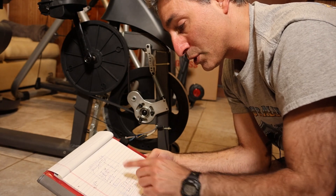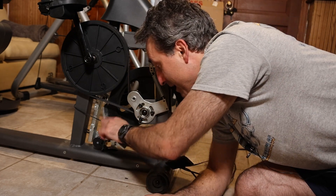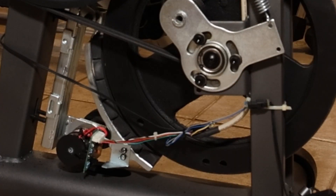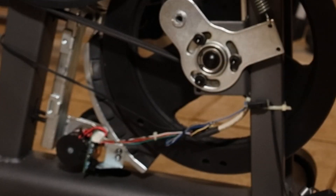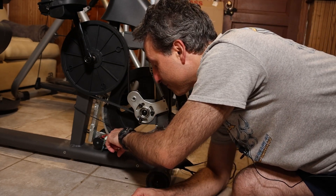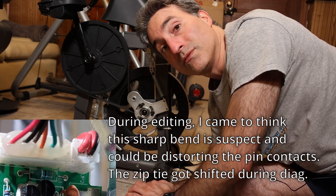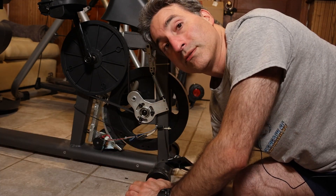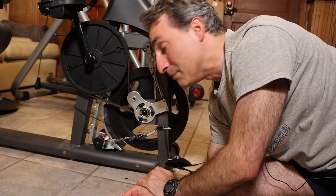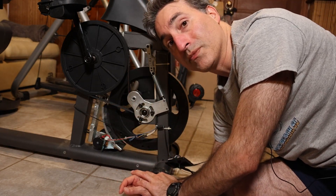All this other circuitry is for those optical sensors. The funny thing is, when I plugged this back in after playing around with the power supply, it's working. If I turn this on, it's driving fine. I suspect maybe there was some oxidation built up on the connector pins, and it started to produce resistance so the motor couldn't get enough power. I kind of just wiggled these around, made sure I seated them, unplugged and re-plugged them a couple of times to make sure those contacts have wiped. Hopefully any oxidation that was on them is off now.